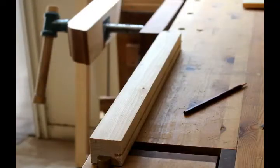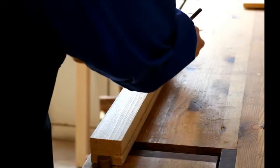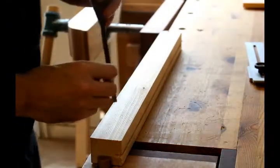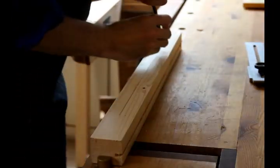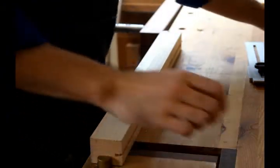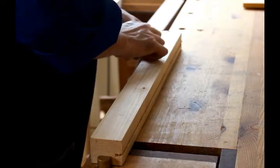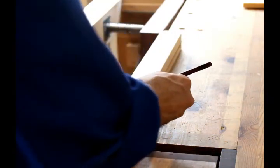What I do is take my piece of wood and start by marking off the start and end points for the dado. Then I use my special depth ruler to draw a straight line for one side of the dado. I then take a chisel which is the width of the dado I want to make — in this case it's six millimeters or one quarter inch — and I tap in the start and end lines of the dado. I then take my special depth ruler again, set it to the width of the dado, and draw the line for the other side so I know where I have to cut.